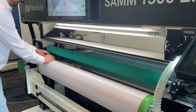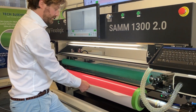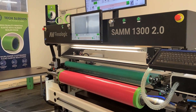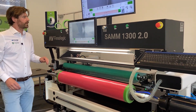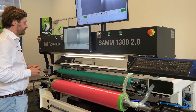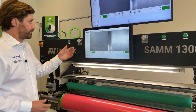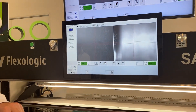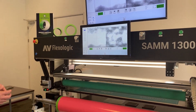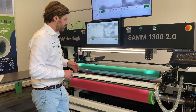Now I remove the liner, then I can use the foot pedal to rotate the sleeve. Now: 'Create Job and Mount' — that will bring me to the mounting screen. You can see there's an eight-color job, then one plate per sleeve. I press 'Next Plate' and it brings me to my first plate. You will see the cameras are moving automatically to the right position. The front table will move down and underneath the mounting marks for optimal image recognition.